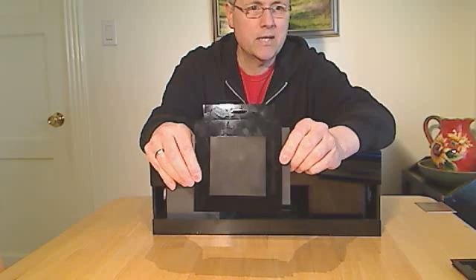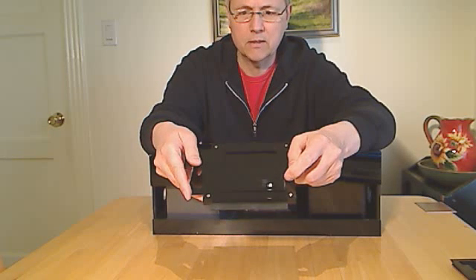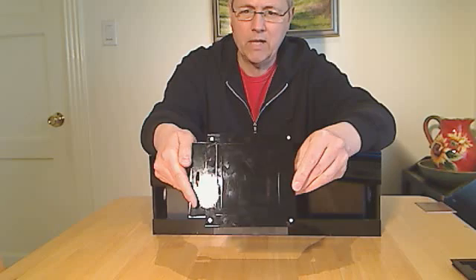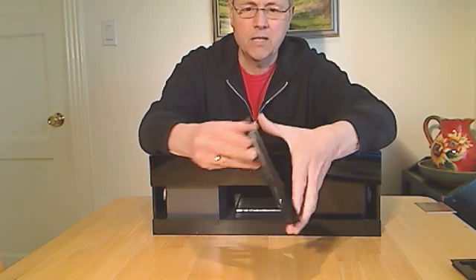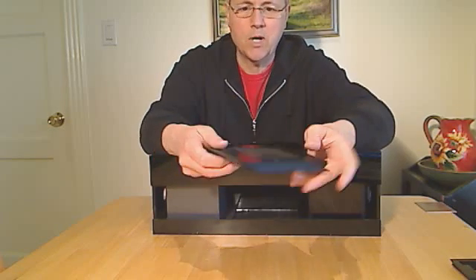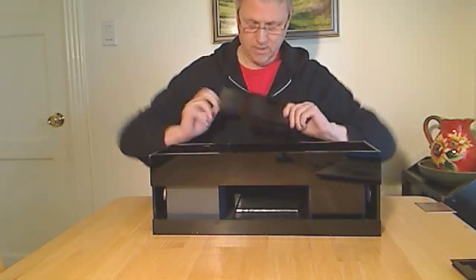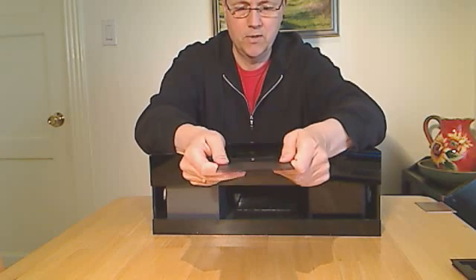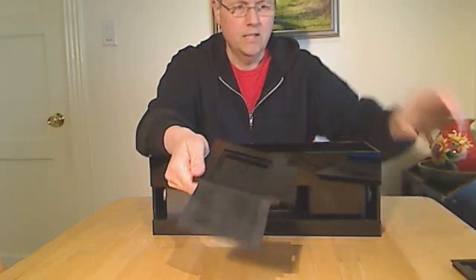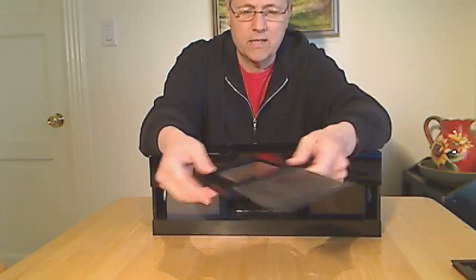This particular one is laser-cut acrylic, and it's designed to be held together with rare earth magnets to make it easier to mount to a camera. I have a plate that's designed to fit on the back of an 8x10 that lines up four rare earth magnets. The piece also splits into two using a rare earth magnet coupling. The outer part is designed to let you hold the plate. It's definitely not tight because you don't want it to open during your photographic operation. Inside, it's designed to hold the 6th plate — this is a sample piece of copper. The laser cutting is quite accurate, so it fits really cleanly inside that setting.